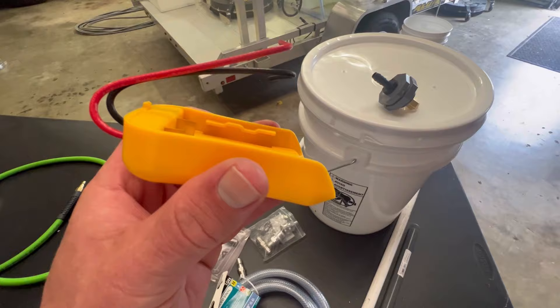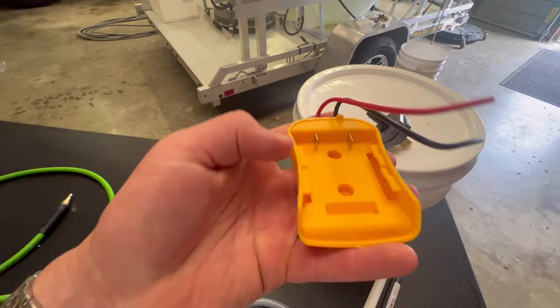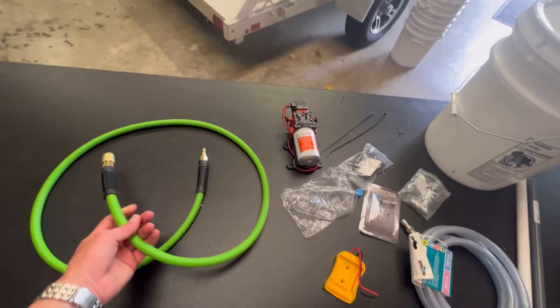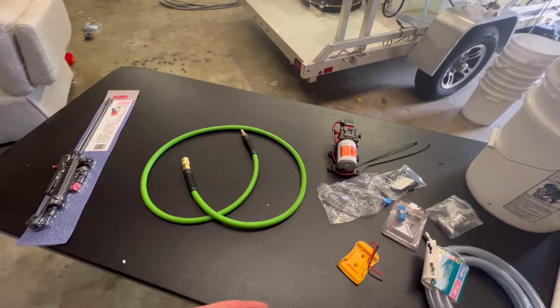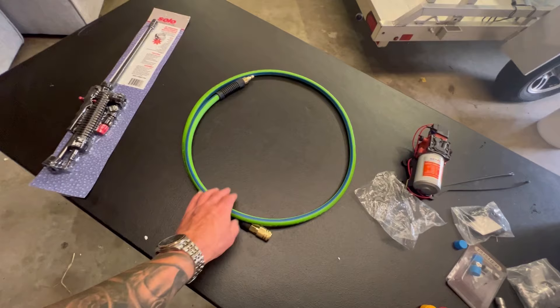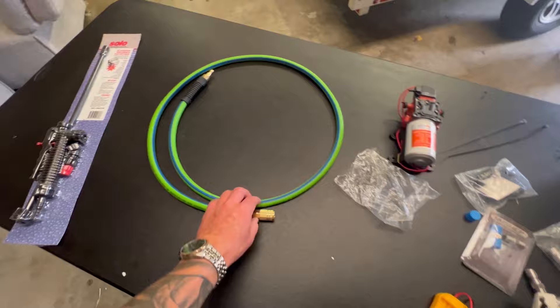To power the pump, you're going to need a battery adapter — you can buy these on Amazon. I just upgraded some of my drills to Makita, but I'm going to utilize a DeWalt battery on this setup. The heart of the system is your pump. Get yourself a one-gallon-per-minute pump at 100 PSI — this is going to be perfect. This one's built by Seaflow. For the actual sprayer hose, I've got some three-eighths air compressor hose. A lot of guys go really big on the length — running 15 to 25 feet — because they're sealing pavers and want to set the bucket down and walk around freely. I don't mind carrying the bucket around, so I keep mine short — about a six-foot section of three-eighths air compressor hose. I'm going to be cutting the quick connects off. You could set yours up with quick connects if you wanted to take your hose off, but we're not going to do that on this one.